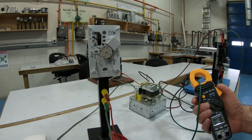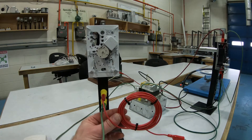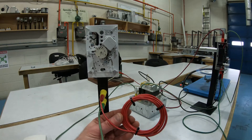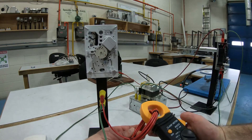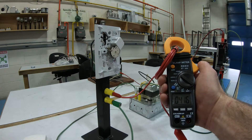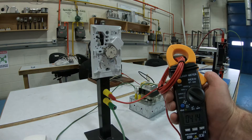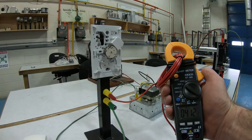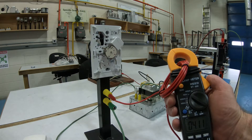If this reading was too small to show up, I could use a 10-loop multiplier — just a wire wrapped up with 10 loops. I put that on there and you'll notice it reads 4.17. What it's doing is increasing my measured amperage by 10 times because I have 10 loops, so I'd take that number and divide it by 10. I'm still at approximately 0.4 amps.